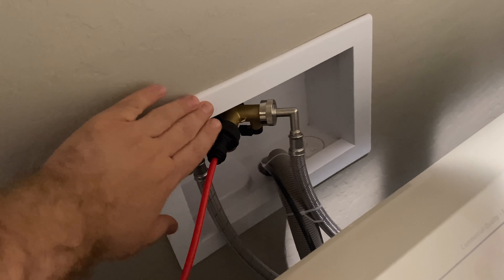For now, these have flat bottoms so they're pretty sturdy by themselves. I have a 150-gallon-per-day output — you can see it's just spitting out RO water, so this thing will fill up real quick. I've got a float valve coming. I'm just going to drill a hole in the side of the bucket and attach the float valve so as the water rises it cuts off.